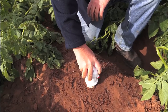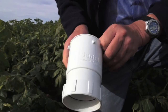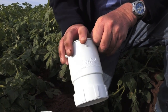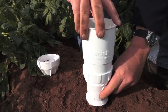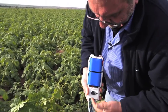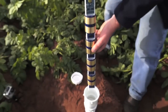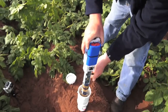We just make a slight turning movement and push down. Now we're going to install the all-in-one, which is basically a probe, a battery, and a modem. For that one, we screw on the extension bit on top of the top cap. You see where that little magnet is — we align that with the little two lugs at the bottom there, because that is the right positioning. And we just lower that now into the probe.